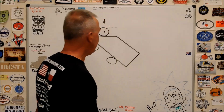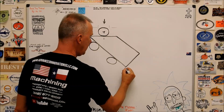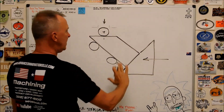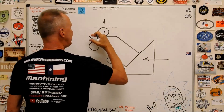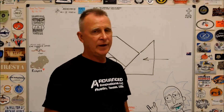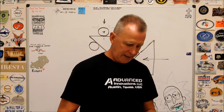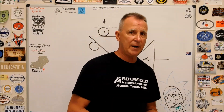It's going to be there all day, every day. The other beautiful part of this is if you put an angle block against the bottom, as you push that angle block, it's going to push the pin up because it rides up the incline — it's going to rotate and register. This is a very solid method for drilling, working with, locating, or measuring pins that have a cut feature on the end. Let's take a walk out to the mill, make a quick little plate, put pins on location, duplicate this part, and pop a hole 30 degrees perpendicular to the end face. Let's go.